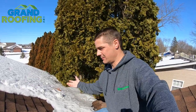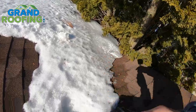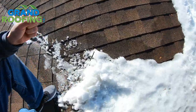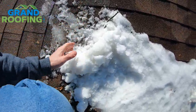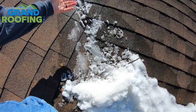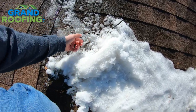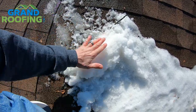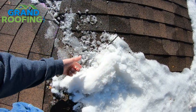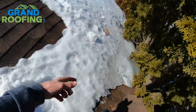For those that want to watch and see what ice damming is, it is essentially this big hunk of ice causing a dam. Now, for my highly scientific model I made here, it's just some snow packed up into a little dam. Water's melting and flowing up to this obstruction, aka ice dam. It has nowhere to go but fill up and pond up to this area until it either trickles around or over. It's also probably going to trickle under a little bit, but it usually melts faster than it goes under and off — hence the ice dam.